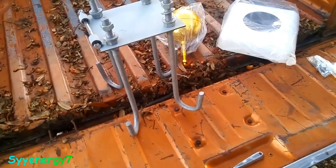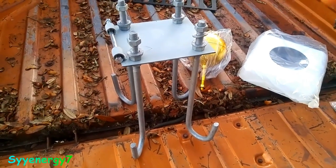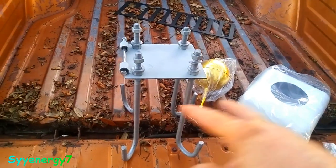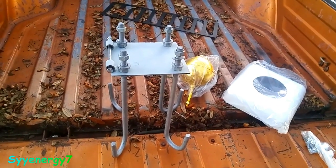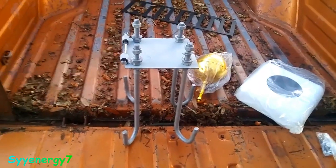What I'm going to do is get some cement blocks and rebar through the cement blocks. These hooks will go in the holes of the cement block, then I'll fill it up with three or five thousand pounds-per-square-inch concrete. I'm probably going to put these into two cement blocks with rebar going down, because this alone doesn't seem super strong to me, but with cement block and extra rebar it should be fine.